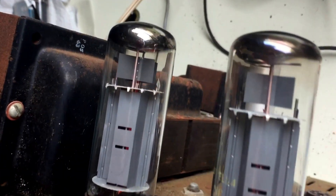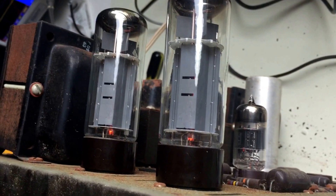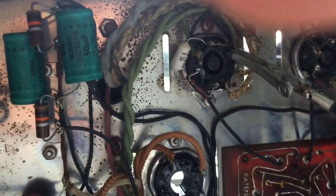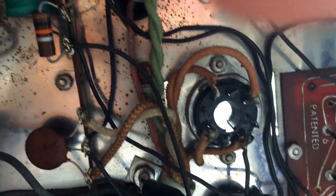Right now I have a couple of measurements I'm doing. First I just wanted to show that the tubes are actually running on the system — there's a nice glow, it's hard to see in the daylight, but they're glowing. As well as the 7199 — I only populated half of the circuit, I only have one 7199 and it's only running on this channel. Up top is where the stuff is, and there is no DC — I don't have the rectifier in.